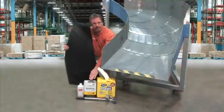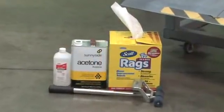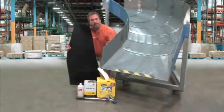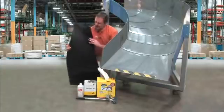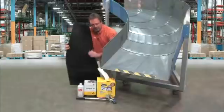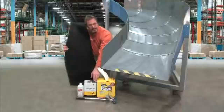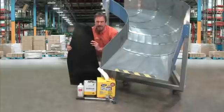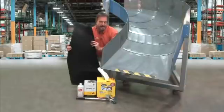So the first thing we're going to do is use some acetone or some MEK to really break down a lot of the heavy buildup that's in the chute. We're going to follow that up with a wipe down of isopropyl alcohol. At that point we're going to start installing our panels of DuraSurf STS. Once the panels — which we've already had cut to size — are in place, we'll make sure that we use mechanical pressure. In many cases what we recommend is a roller like you see here, and we're going to use that to apply mechanical pressure to the part once it's in place. The installation is very quick, very simple, and the beauty of this system is it can be very easily retrofitted into almost any system that's out there in the field today.